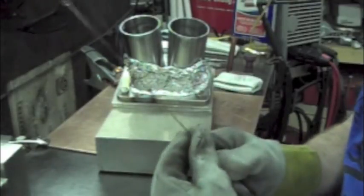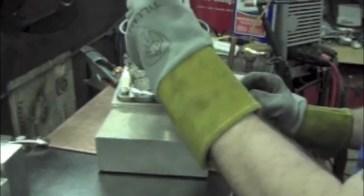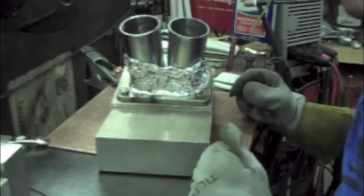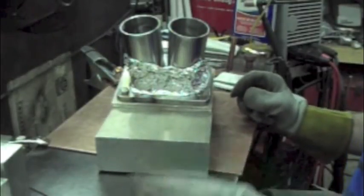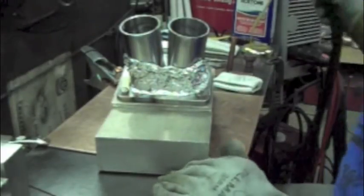It's my own little signature. Everybody has their own preferences and how they do that. But this is gonna withstand the heat because I'm gonna be using a lot of heat down here, washing this around, and it just makes it a little easier. If I tried to reach down there with 035, it wouldn't happen. So this is one area I'm gonna use 1/16 in. And the other thing I'm gonna do is I'm gonna switch out to my monster nozzle.